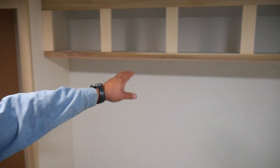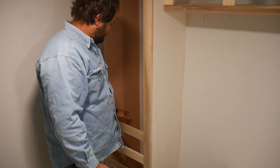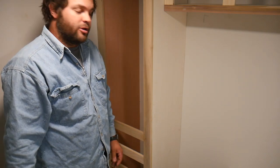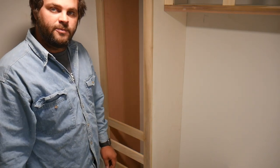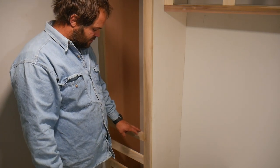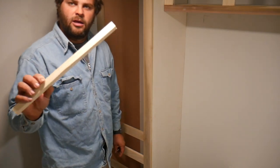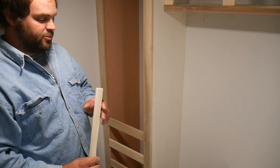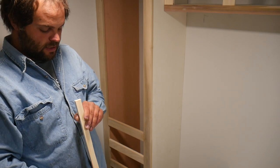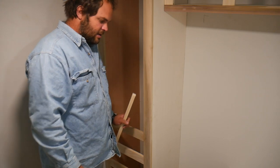I ran out of memory card there, but I got this done. The only thing I lacked is a little bottom rail. So the next thing I want to do is put a bottom floor — I guess you'd call it — in this upper cabinet, like a closet floor. I went in and made a few marks that are a half inch underneath the top. I'm going to take some pieces — they were 1x3s or something — and ripped them to a ¾ by ⅞ little board, then lay them in there and pop a few staples in to hold them.